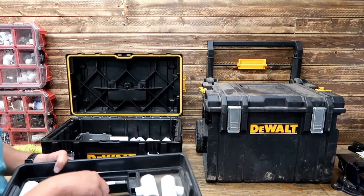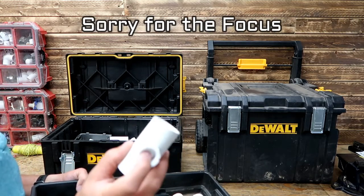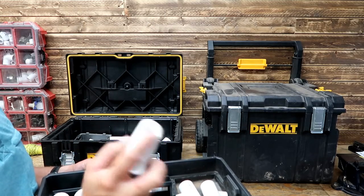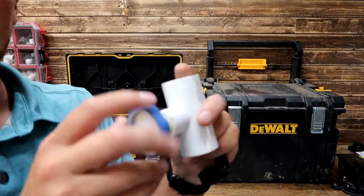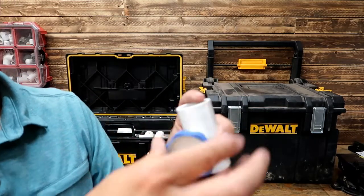So here we've got our 1-inch tees, slip with a 1/2-inch thread inside them. This goes in all of our lateral lines. We put drains in here. We put swing pipe extensions. These, and the most often thing we screw in here, we've got this king drain. This will screw in here in a lateral line and discharge the line when it's not charged with water.